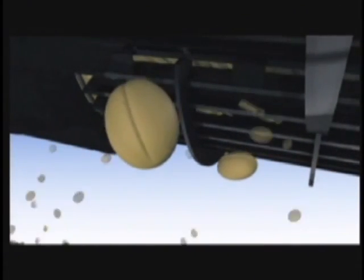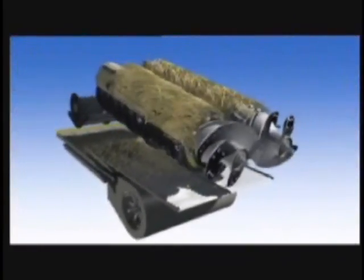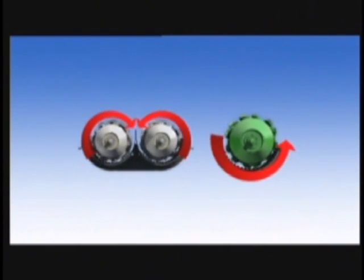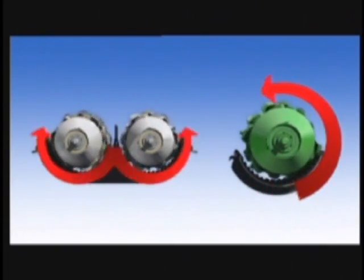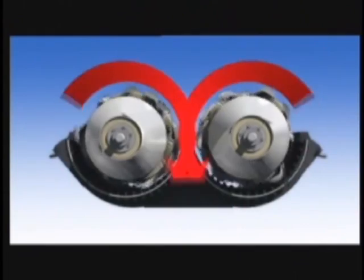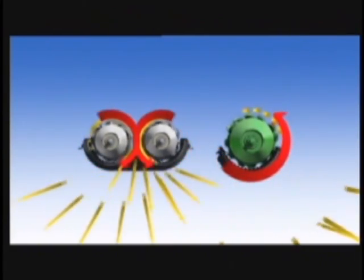Now to weight. The weight of one kernel of grain is about the same weight as the one next to it at the time of harvest, so weight is a constant factor. So here's the big difference: turning radius. Centrifugal force is increased significantly by a smaller turning radius, and the CR Twin Rotor has it. Each of the twin rotors has a smaller turning radius than that of a single rotor, providing more centrifugal force than any other combine on the market today. The inertia created from this centrifugal force helps grain let go quicker and get out quicker.